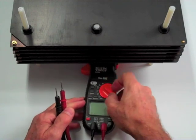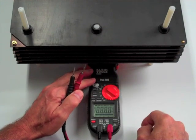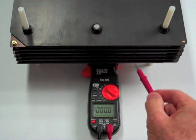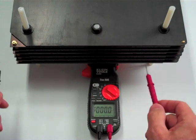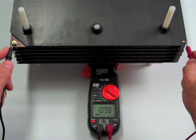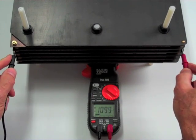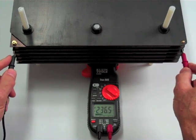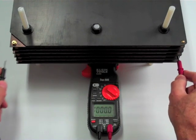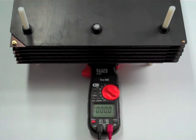Now we're going to put it on microamps and just short it. So we'll short the cell for just a couple of seconds — you don't want to do this a long time because you weaken the cells. Don't run a load that kills the cell, and don't short it out for long periods of time. So here we are: 1.098, 1.096, number three is 1.099. It'll drop if you keep it on there. Cell four: 1.096, 1.095, and the last one: 1.090.